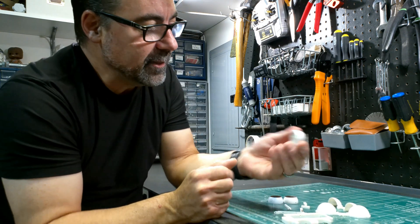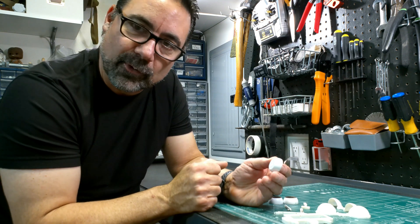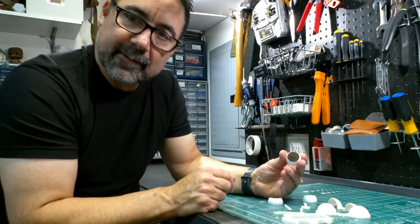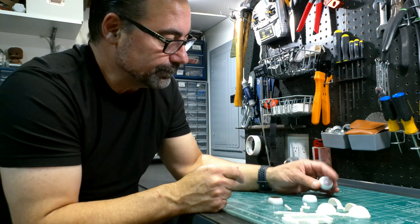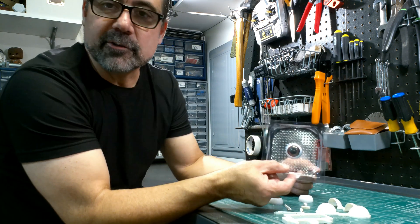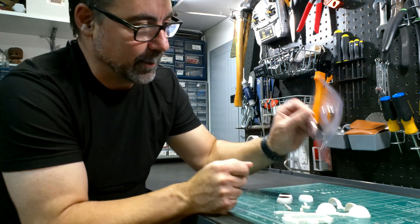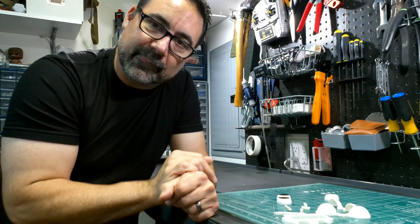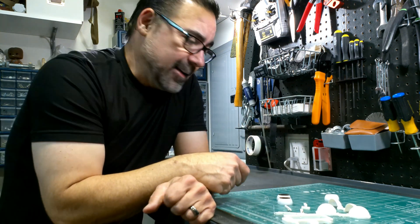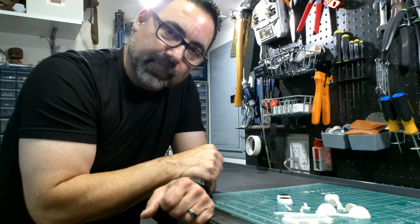The eyes, in order to print them — and I've changed up a couple of different approaches — the eye is not fully rounded like an orb or hemisphere. What I've done is glued a paper printout of an eye onto it, and then that goes into a vacuformed part to allow it to look like an eye. I have prepped a couple eyes with the printout and have a couple of vacuformed pieces. The paper is simply glued on there. I'm going to be experimenting with clear resins over the eyes in a future video, but for today I'm just going to use the vacuformed plastic as my lens.